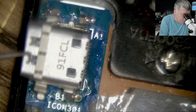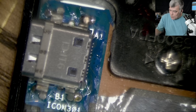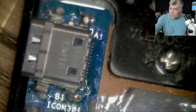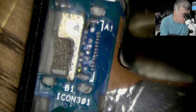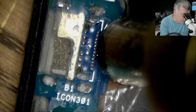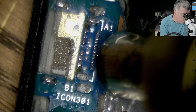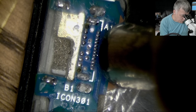I bent the sides of the port. All we have to do now is solder the port. I'm going to come with low temperature, around 250–260 degrees — at that temperature you cannot melt the plastic. Flux. You can see how it's getting melted. I think it's fine, let's try to put the port.